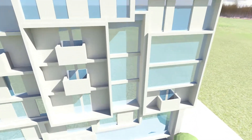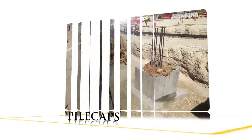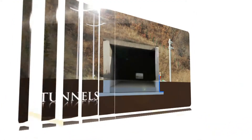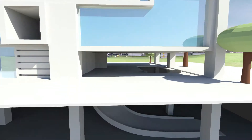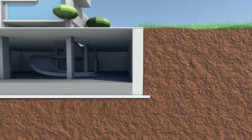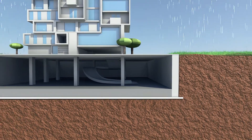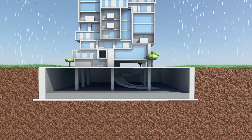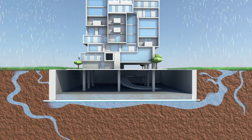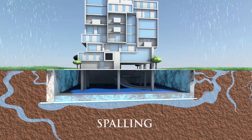Parts of a building which are exposed to soil, such as basement, plinth, pile caps, or structures like bridge piers and tunnels, need to be protected from water. Their stability relies heavily on the strength of their foundation, making waterproofing for them indispensable. Apart from groundwater, below ground structures get attacked by the minerals and chemicals in the soil and the release of effluents from neighbouring urban built-up environments, causing corrosion, spalling and seepage.